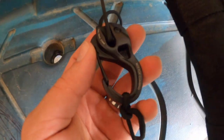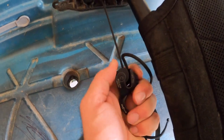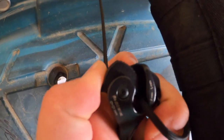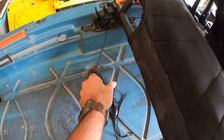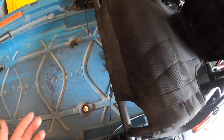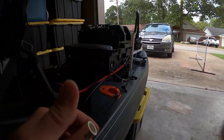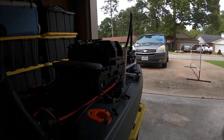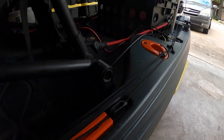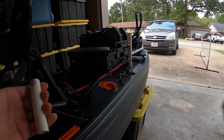That's why this cam jam is very important. When I want to lift that motor up, all I do is loosen this piece — loosen, loosen, loosen — and set it down. See how loose that is; it's not in anyone's way. Then I take the pulley and I can pull it up as far as I want, and it locks right in place. And then when I'm done, I lower it back down.